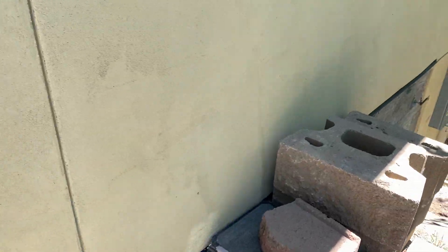The main point of this is: if cracks are mostly cosmetic, you've got to be careful — there's isolated staining and cracking that can be an indication you have a problem. But a lot of cracking like this, just random cracking, is normal. Water will let a little bit more in, but you have a moisture barrier there to deal with that.